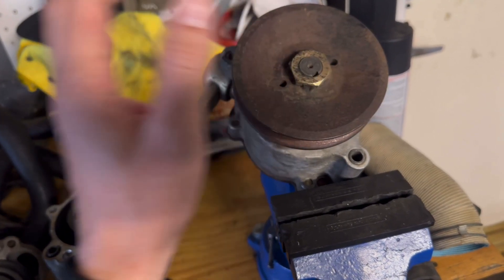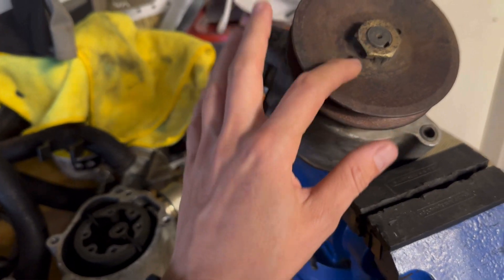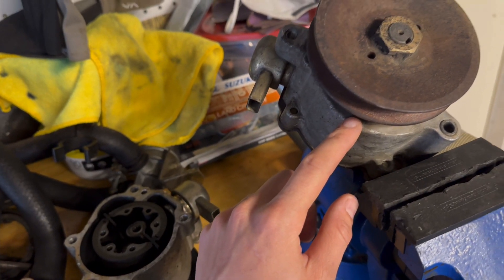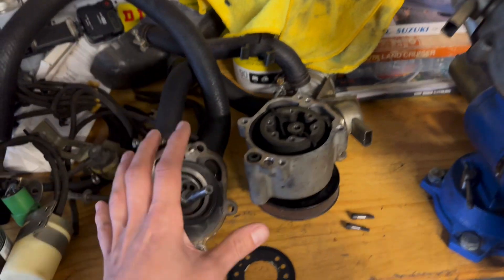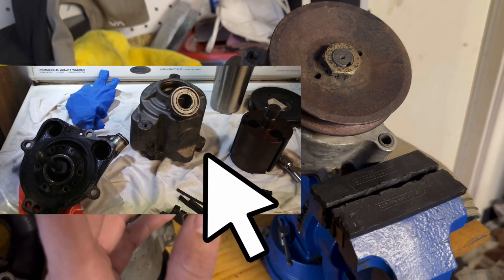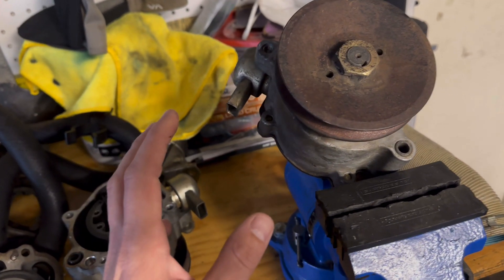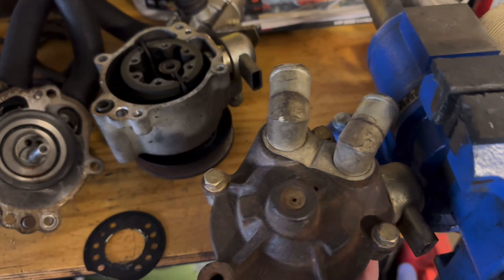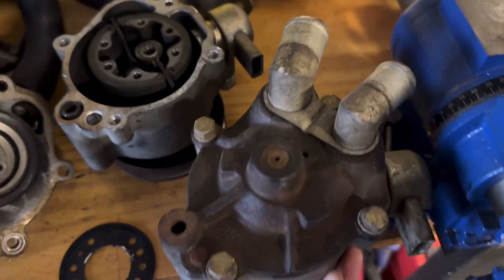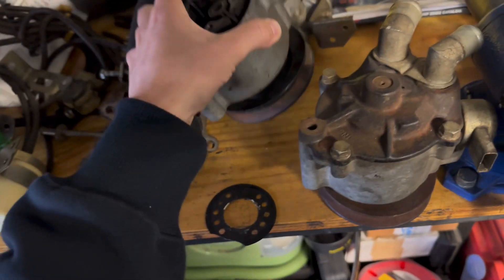Instead of being able to rebuild it, now you've got a stripped shaft and you can't really do anything with it. I'm not going to go that far in. You only really have to remove that nut when you're changing out the main bearing that's pressed into the aluminum housing — which, again, I'm not rebuilding this, I'm just re-greasing it. That step can be found in another YouTube video link I'll put in the description — they go over it very well. The unit itself is used in quite a few different applications, but if the casting looks like this with the four main bolts, you're essentially going to be doing the same disassembly.